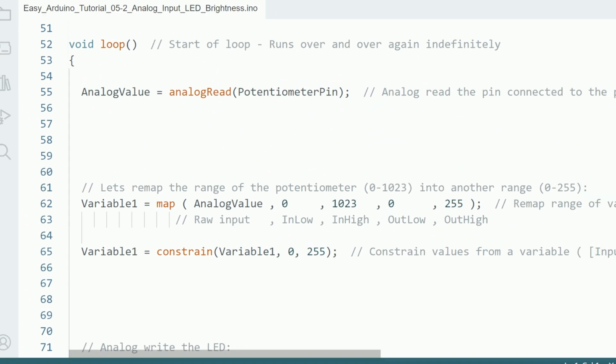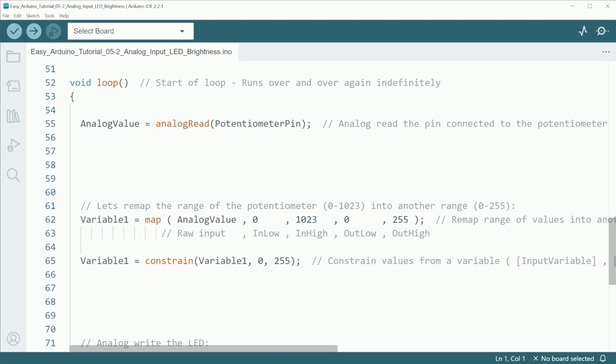You don't have to remember the details of how to write everything though. What I suggest is always using examples to copy-paste the code of what you want. Even after many years of programming Arduinos, I still use this technique all the time. The reason is that the code is sensitive to upper and lowercase letters, and any small mistake writing the code will cause an error message or a weird behavior. So it's better to copy-paste codes that you know are good, instead of writing everything manually.